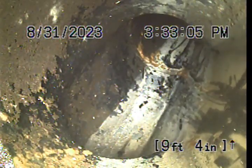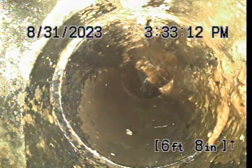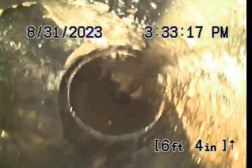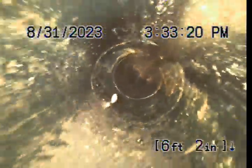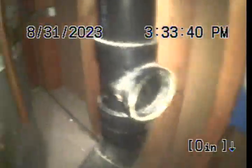I'm going to pull back the rest of the way now. That Y fitting is only 10 feet away from our clean-out. Typical waste build-up from the pipe. There's a toilet just above my clean-out here. There's a tie-in underground — 4-inch, it looks like, or 3. Alright, we're pulling up and out of the 3-inch clean-out tee. This is where the work was performed today.